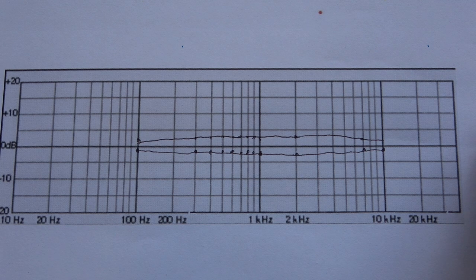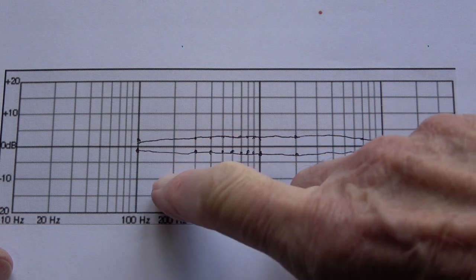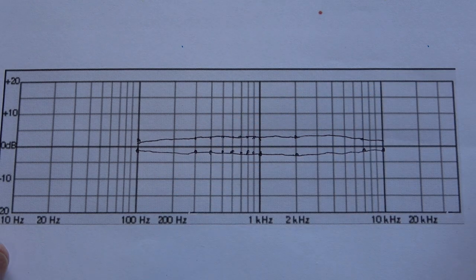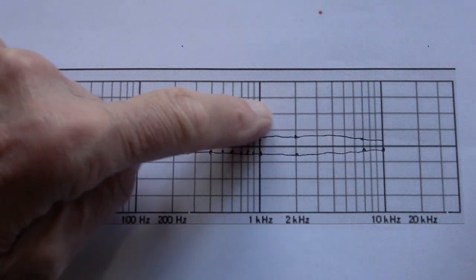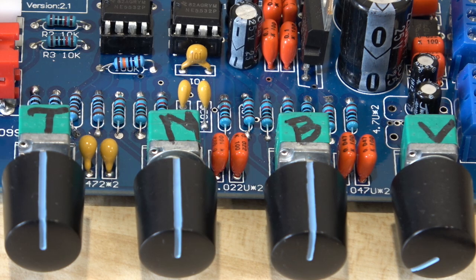This graph shows the effect of the mid-range control. Mid-range is one of those frequency bands that's really just speech, and it tends to be an unpleasing band. Cheap and nasty transistor radios used to have a response from about 200Hz up to about 2kHz — and that's basically the effect of putting the mid-range control on maximum boost.